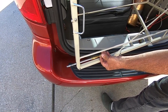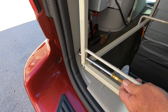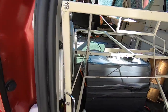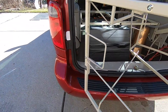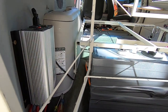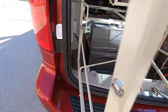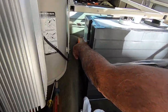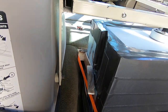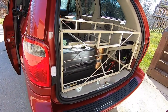And I made another pin right here — recycling. It's part of a fireplace part. I drilled a hole right here, and when you close this all the way in, that pin can be pushed into that hole, and that stabilizes it. Back here, there's a little notch, and that notch coordinates with the bed right there, which supports the front side of it. There's also a ramp — an actual ramp of metal right here that helps to guide this thing up because it's heavy. It ramps it up, lines everything up, and then you close her up, latch it, push the pin in. She's solid.